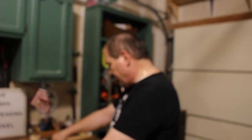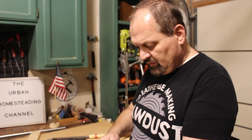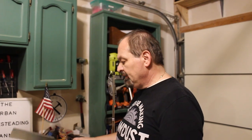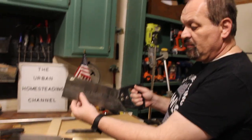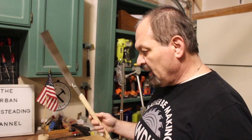I like to protect my saws. It's supposed to have plastic blade guards on both sides — I've lost one side. If you have them, don't throw them away; it's a good way to make your saws last a very long time. If I knock the saw on something, I don't do any damage to the teeth. And if you do damage the teeth, the saw will bind. If this thin saw binds, it's going to turn on you. Unlike the thicker saw, which if it binds will make it harder to cut, but it is very hard to bend.